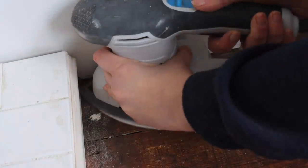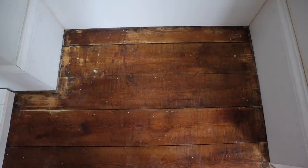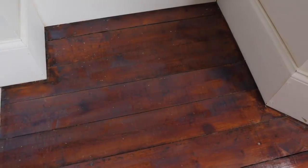Once the sanding is done I'll vacuum it all up, clean the wood, let it dry, and then apply varnish. I did two coats of varnish on the entire floor originally so I'll do that again, very gently brushing it onto the already-varnished areas so it blends in seamlessly. Between each coat of varnish I'll use a fine grit sandpaper to go over it quickly and make sure there are no bumps or scratches — this gives a really smooth effect on the floor. I'll spend the next few days doing this around the entire dining room and sitting room.